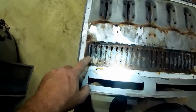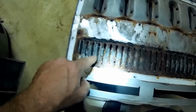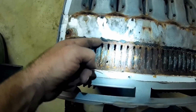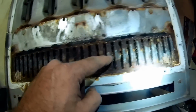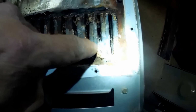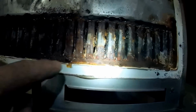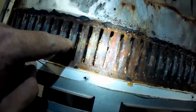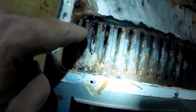Okay, what I'm looking at, this is that same 340 MAV furnace. Now, you can see all the polypropylene lining is actually gone and it's starting to rust and rot. Well, this cell is almost plugged. A lot of them are almost plugged. So what happens is, you see this one's plugged up with stuff.